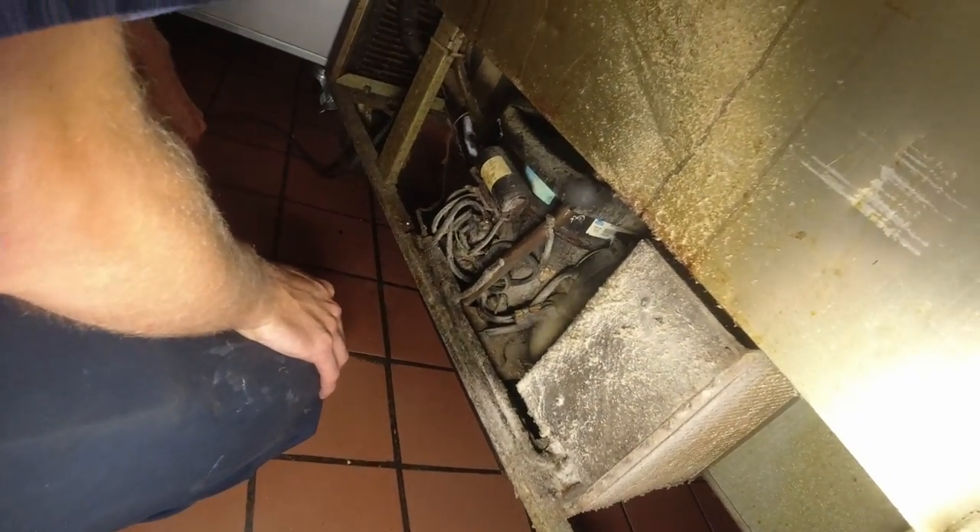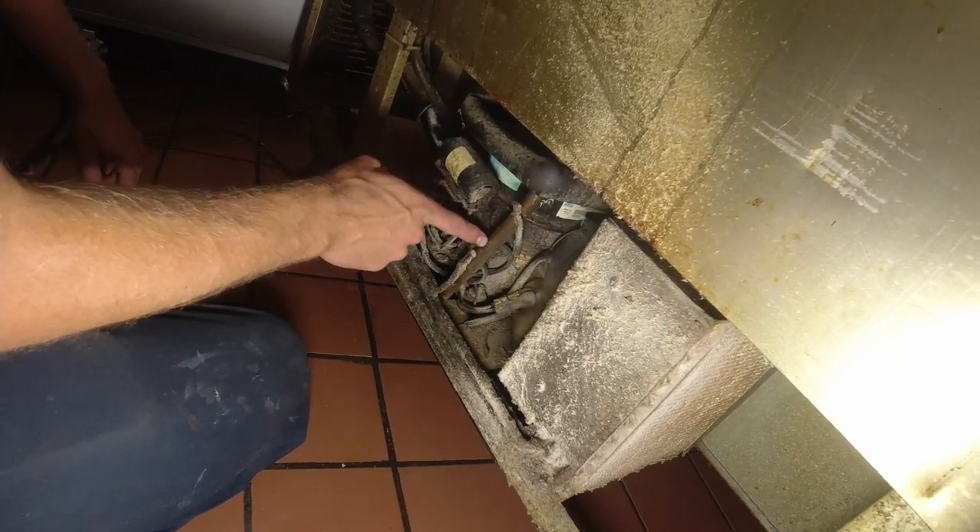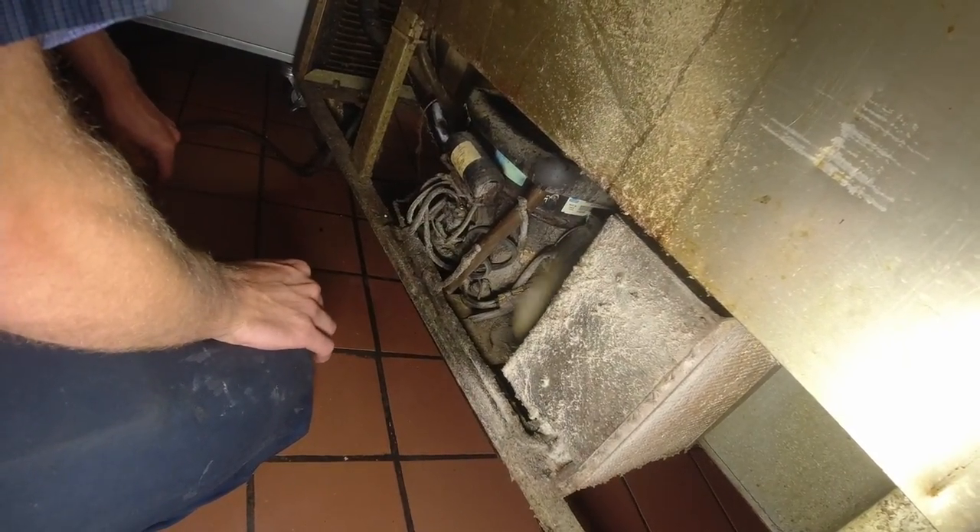How's that drain line on the left? Anything coming out? Doesn't look like anything's coming out. Is there anything in the pan? I can see water down in there, so it is draining - this may not be draining fast enough. We've got one here too. Probably should get both of those cleaned out.